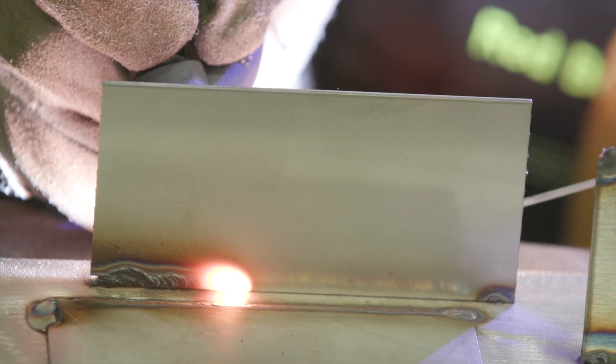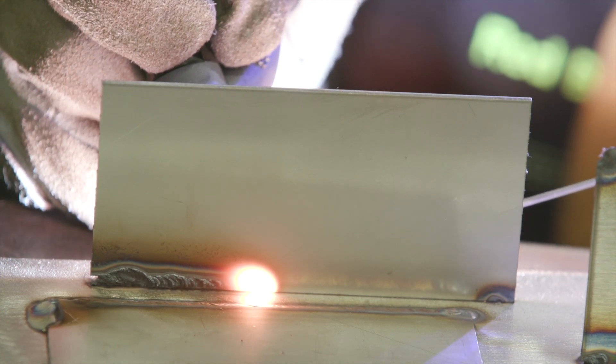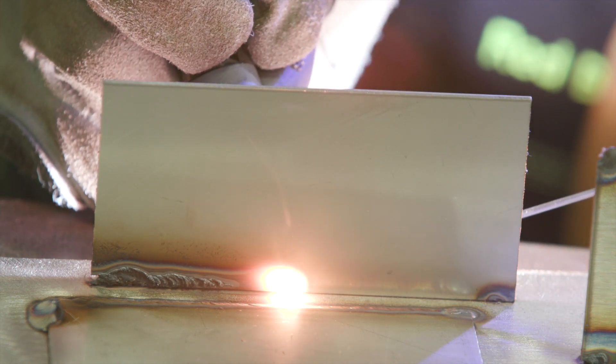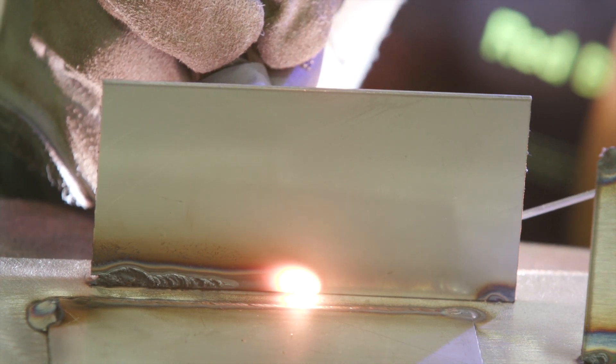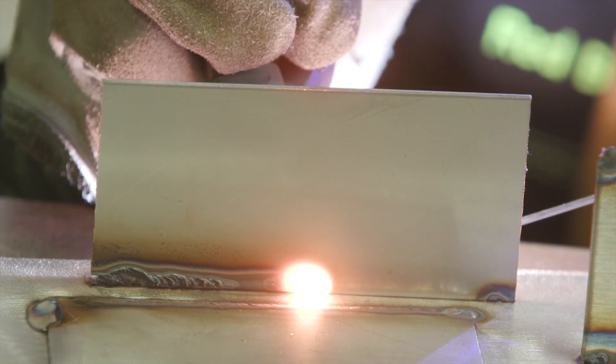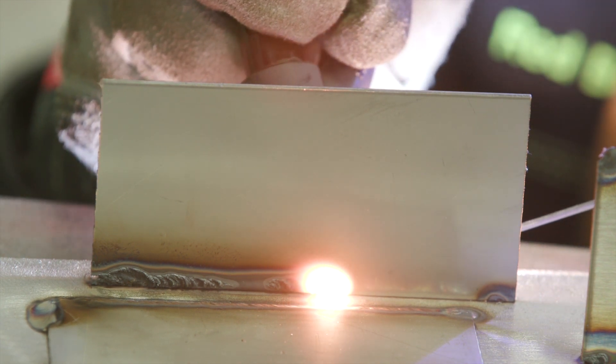This is the back side of the plate — you should be able to see that sugaring occurring in its natural environment. The downside is I can't see it from this side, so I don't even know if it's occurring or not. I'm just welding along, minding my own business, while meanwhile the back side is getting torn up because I'm using the improper work angle.